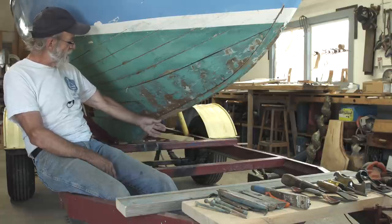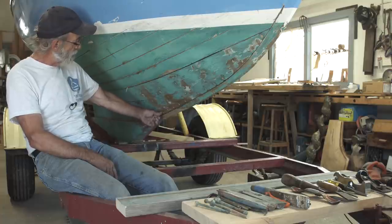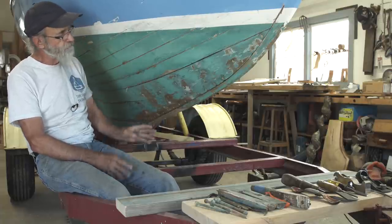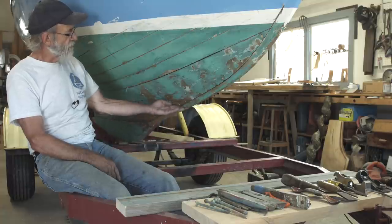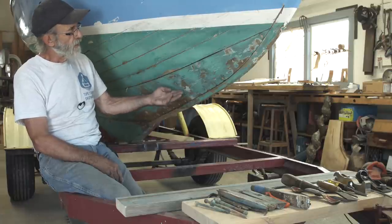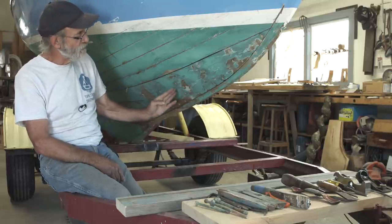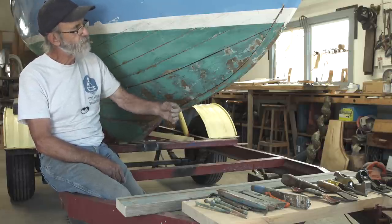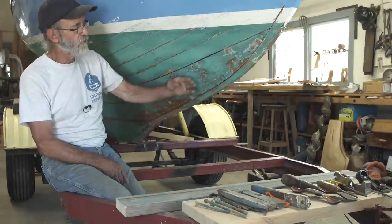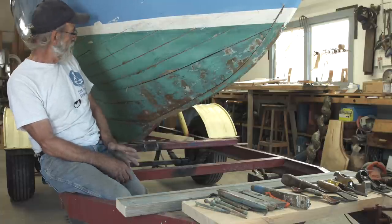This piece is what you caulk against when caulking this seam — you're pushing cotton between the garboard plank and this piece right here. So it has to be bolted up solid and glued on nice and tight. Some of the screws that came out were number 10 by an inch and a quarter, and I put number 12s back in exactly the same holes. We didn't drill any new holes — we extracted the screws, put number 12s back in, they held perfectly tight right in the same plug hole, re-plugged in the same holes. It doesn't have one extra hole in it, and it's all buttoned right back up and ready to go.